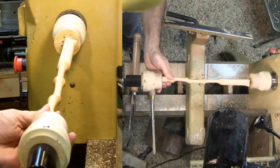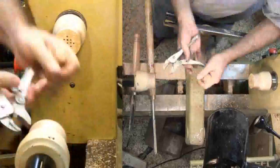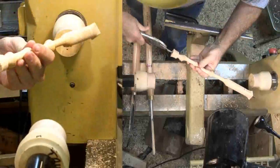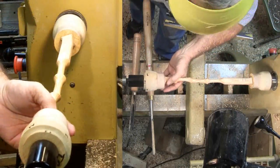This is the final offset transition. I'm being careful to place the pins in the correct holes. On the opposite end of the blade, I'm making sure the pins are directly opposite those on the other end, then double checking that I get them in the right holes in the tailstock faceplate.